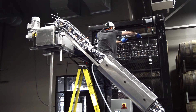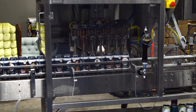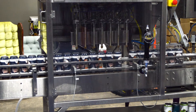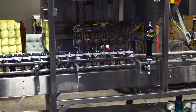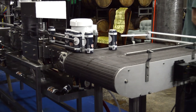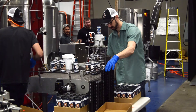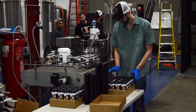The first step, the cans get offloaded from the pallet and they go through a twist rinser. Then the cans come underneath the filler heads where they're first purged with carbon dioxide — we do that because we want to push all the oxygen out of the can. Beer's worst enemies are light and oxygen, so we want to get all of the oxygen out of the cans that we can. Next the lids fly down on top of the cans and they go through the seamer, which actually folds the aluminum around itself and creates a tight seal. The cans get rinsed off, and then Josh packages them up in four packs and puts them in cases.